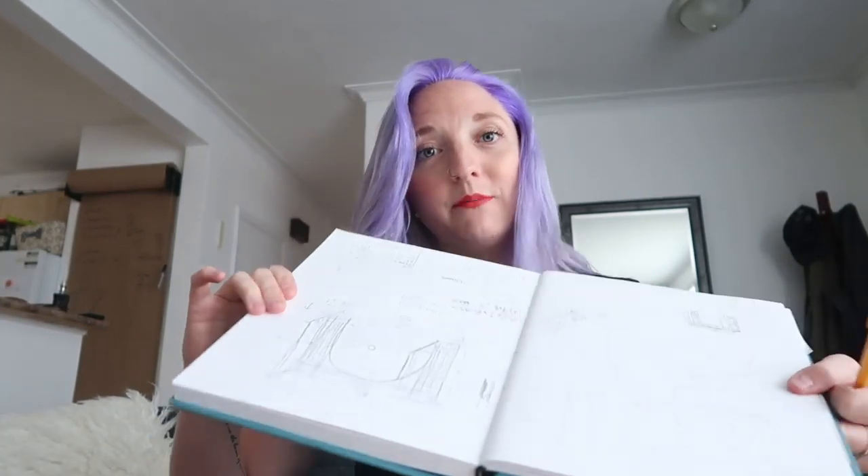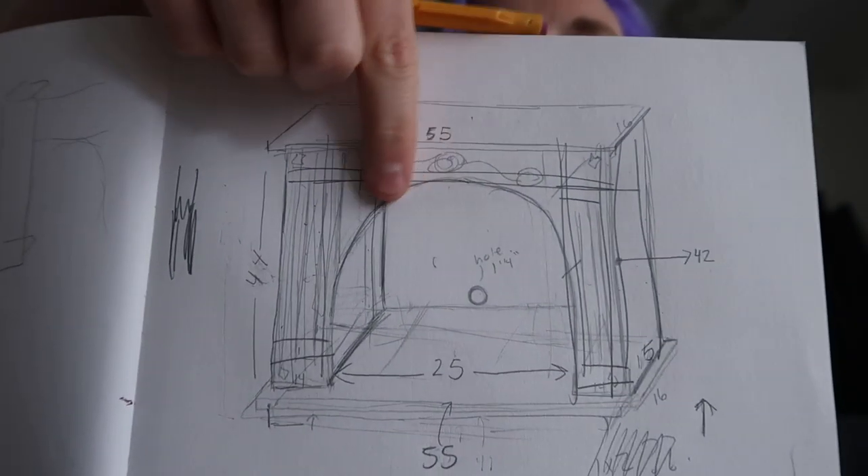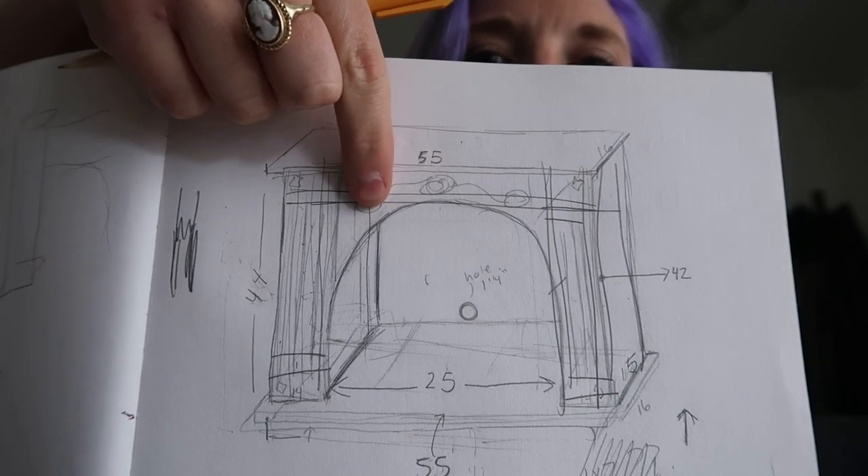I love the idea of a fireplace — I think that's genius. It was time to DIY design. So we're building a fireplace. Here's what I've sketched up: there's a nice archway, some molding up on the top, maybe on the sides. The materials I'm planning to build this out of are MDF and 2x2 wood. I'm essentially going to build a frame using the 2x2 pieces, and then the exterior is going to be built with MDF board. I've got my outline and measurements, so I'm ready to go to the hardware store.